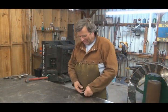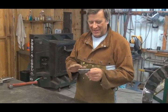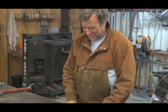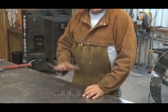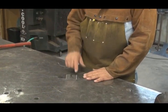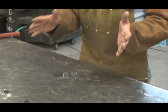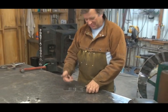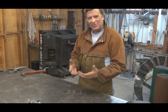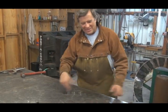So I've got four little pieces of eighth-inch plate that I just pulled out of the scrap bucket. Cleaned them up a little, chamfered the edges a little so you can get a decent weld. What I want to do is make one weld at really low voltage, one weld right about the right voltage, and one weld really high — to show you the difference between what the welds look like. You can look on the back side and see what kind of penetration we're getting, what kind of discoloration we get on the metal, and how much heat is actually getting through. Put your helmet on, we'll make some sparks.